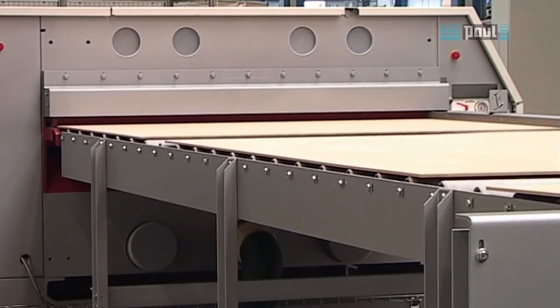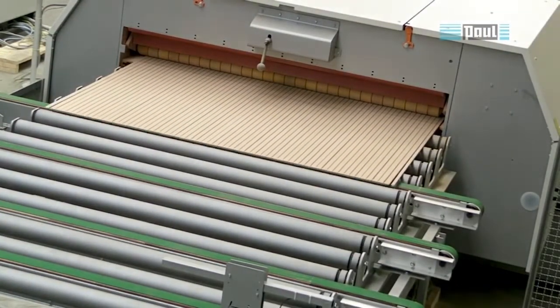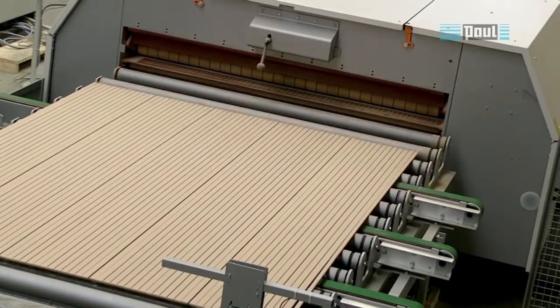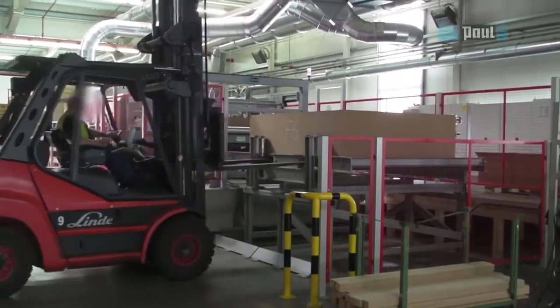There are a lot of different in-feed systems that you can use. It's very important to get the right speed in-feed system, however, for these machines, both before the saw and after the saw. On the outfeed side, we can have right angle transfer belts that take it to the next part of the line, or we can also have stackers.